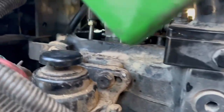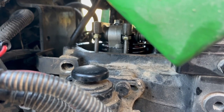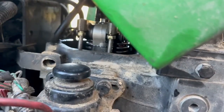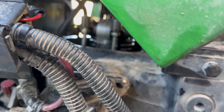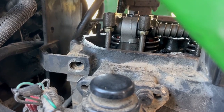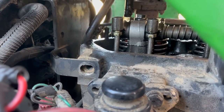To adjust the number three cylinder back here, you can see the intake on the right and the exhaust on the left. This fused link here sits in that hole, so I had to take that off to gain access to it — just a little FYI so you're prepared for that. There's a 19-millimeter bolt right in that hole that's got to come out, and then this thing lifts up — just pry it out of there and get it out of the way. It'll be fun to get it back in there — we'll see how that goes.